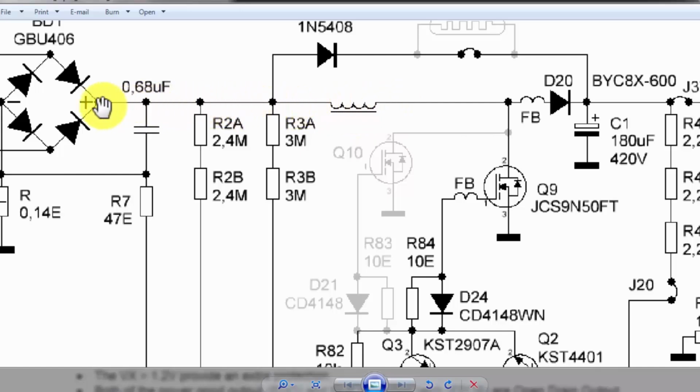Now there is no return path to the backside because we have positive voltage here. This end will become negative, this end will become positive. Now this will become a series voltage source with the output of these voltages. Before turning on, this end was positive, but now with the collapsing magnetic field, this end of the winding will become negative and this end positive. So these voltages become in series and will pass through this diode D20. For example, 270 volt were here and 60 volt we generated from this coil. 60 plus 270, 330 volt will reach here.